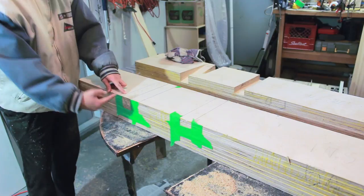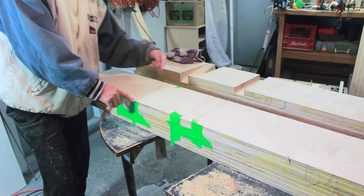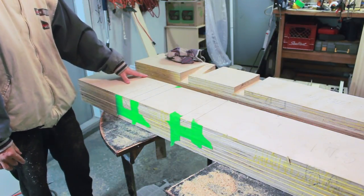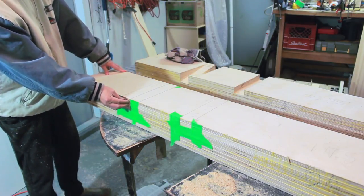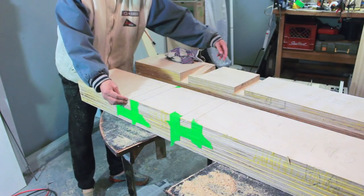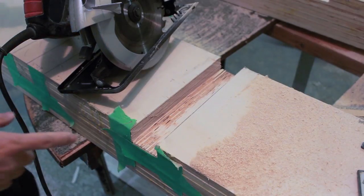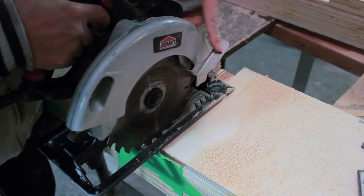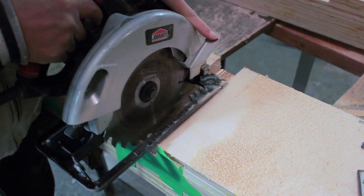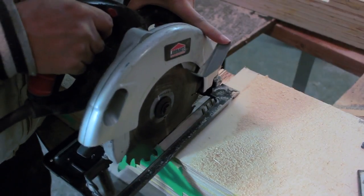The way you see it right here, this piece is going to be cut at an angle, and this is reversed — it's not going to be cut on this side, it's going to be cut from here at an angle. So it's going to look almost identical, except that the back side hole is going to be a little bit bigger. Since this area is so easy and flat, what I'm going to do to save time on chiseling is just move my circular saw sideways to flatten out this part.